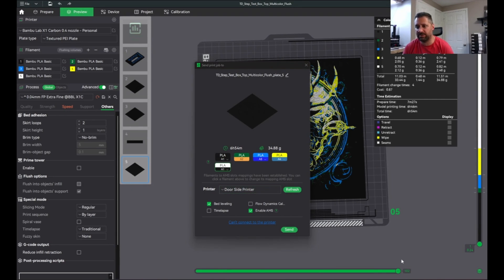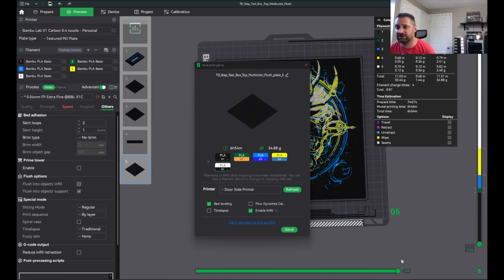Here's a quick bonus tip. I was loading up my AMS — I have two units on my printer but another printer is still printing. The natural white I need is in the other printer waiting to be used. You can do the same trick: load all four starting colors that you do have, and for the fifth color load a random spool of any filament in that slot, set all the AMS slots correctly, then just pull that random filament when the print starts — it doesn't pay attention to what's actually in there once the print starts. Once the natural is done in the other printer, you can load it in. If it gets to almost the end and has to wait for the natural for a little bit, that's just fine — it'll error out because there's no filament in that slot, which is your cue to load it.